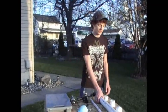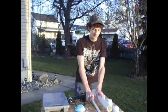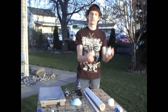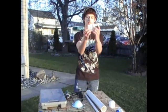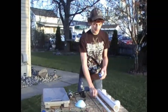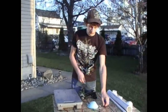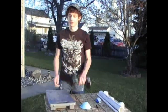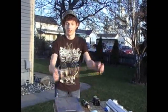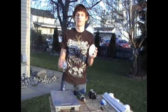First things first, materials. You're going to need two different sized diameter pieces of PVC pipe — one for your barrel and one for your chamber. Then an end cap for the larger diameter, reducers to go from the larger to the smaller diameter, and a regular PVC ball valve for the smaller diameter. Also, a stem valve to pressurize it. To install that, you'll need a drill and an assortment of drill bits depending on your stem valve size. A saw is very helpful, and obviously PVC cement. If you're not in a well-ventilated area, a mask is a good idea because the fumes are pretty intense.